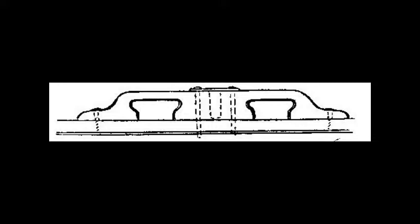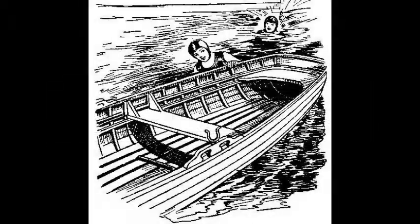The handholds should preferably be made from some hardwood such as white oak or red elm, with fastenings of galvanized or brass. The finish, of course, should be the same as the boat, although a contrasting finish of varnish oftentimes proves very acceptable, especially if the seats, gunnels, transom, and other trim are also finished bright.